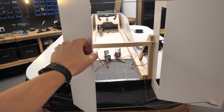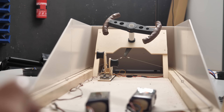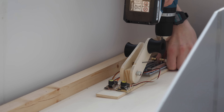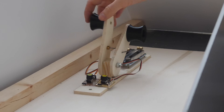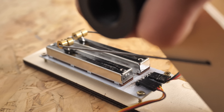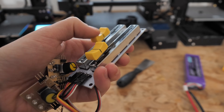I hooked up some aviation steel cable from an arm on the steering column to RC plane style control horns on the tail. I also wanted to have some proper throttle levers to control both the lift motors and the rear motors, so I got some servo testers and hacked them together with some sliding potentiometers and made some. You can read more about how I did this on my website — link in the description.